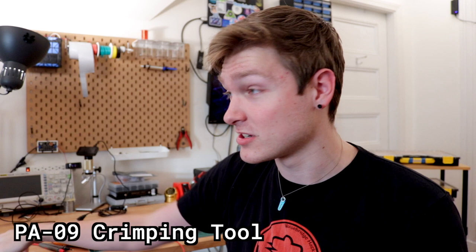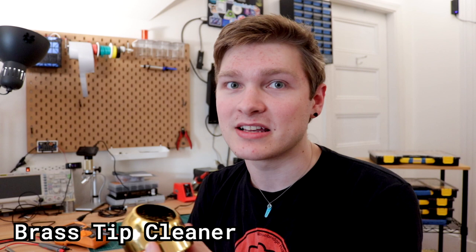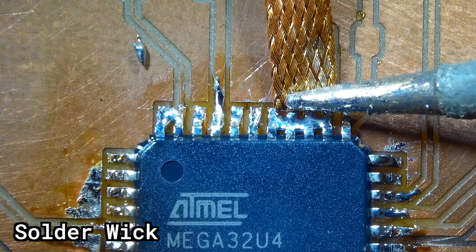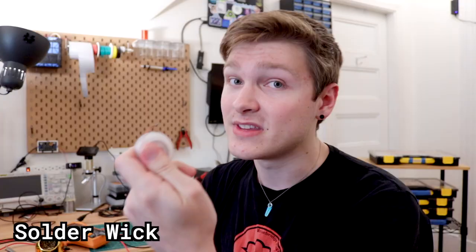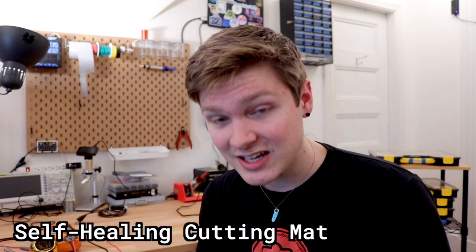When it comes to actually soldering, there are two really helpful tools. First is a tip cleaner for your soldering iron — it's got brass inside, which pulls all the solder off the tip really quickly without removing much heat from your iron like a wet sponge will. Then there's solder wick — the eraser to your pencil that is solder. Especially with surface mount components, it's easy to bridge two leads with too much solder, and you can just pop solder wick in there to pull the extra out. For my workstation I also have a self-healing mat — this thing has saved all of my tables. Super helpful for protecting your tabletop if you're soldering in a place that isn't dedicated to making.